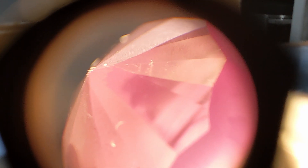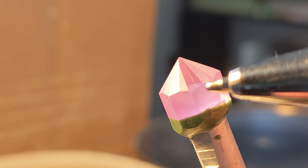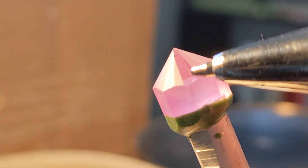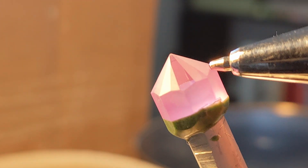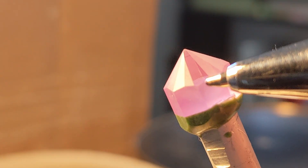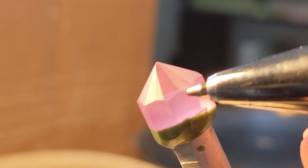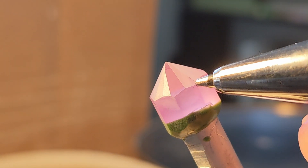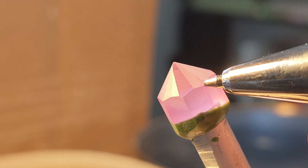I was polishing this out with 1200 as best I could, but I was still getting a bit of those pits and things left over. This may be the best I can do. I went 1200, kind of slower, and cut down below the 600 damage hopefully, and then polished it. It took a while to polish, but it did polish up. I did cut down a little bit with my 600 new bond lap and it started to take away the orange peel.